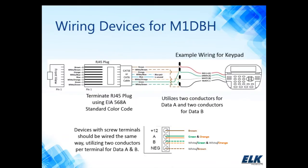Let's talk about wiring for the DBH. We're looking at a keypad here with its wiring harness — about a six-inch wiring harness. You would home run your Cat5 from the DBH all the way to the device and make these wiring connections: the brown wires for power, orange and green for data A, white-orange and white-green for data B. You can see how these connect inside the RJ45 using 568A wiring configuration. We have the data going out to the keypad and back to the DBH so it can go out on the next available port to another device.